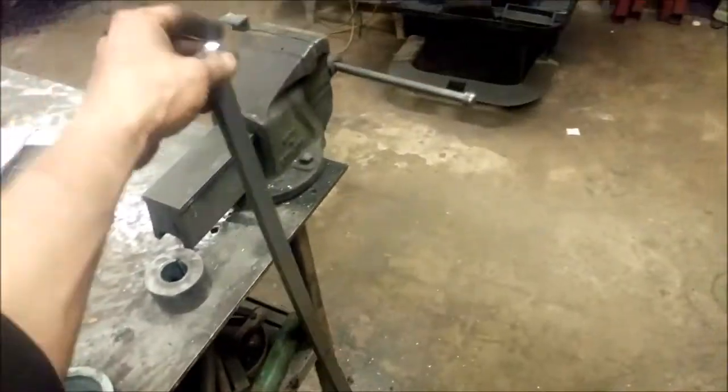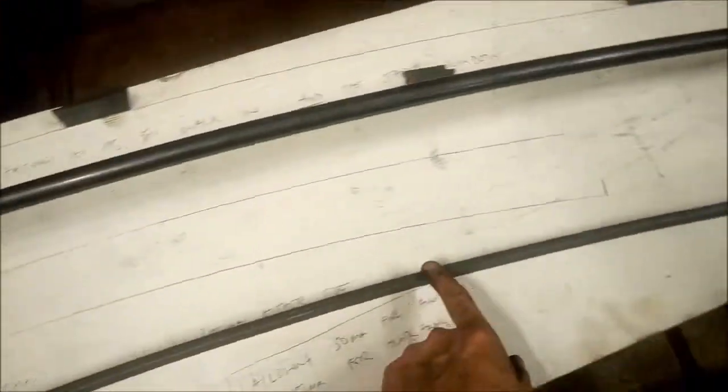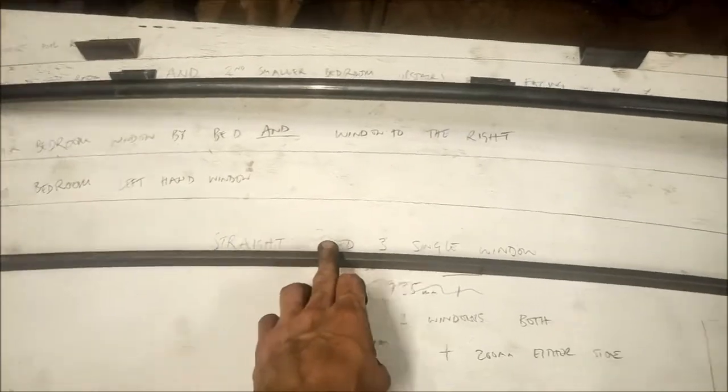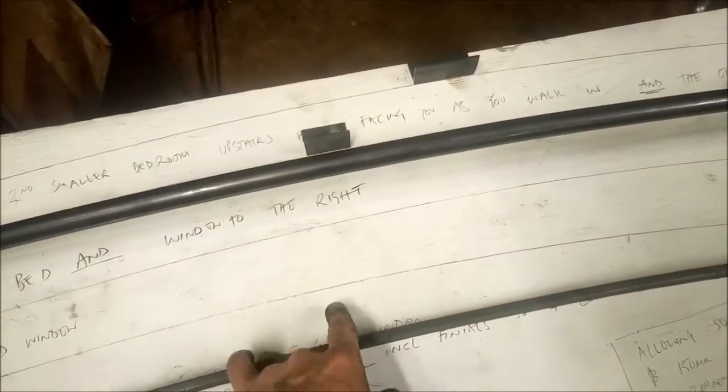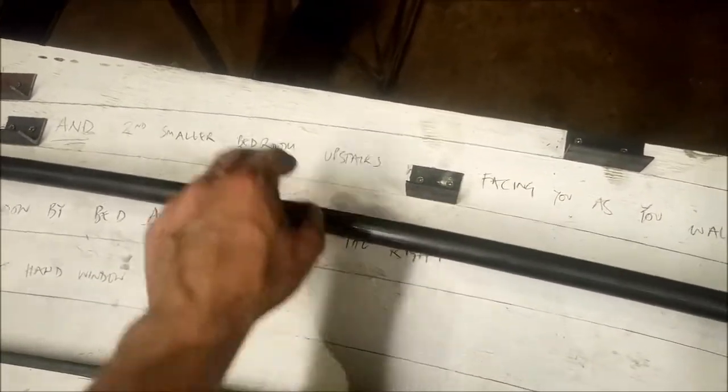Right, so when I went to the client's house, I took my roller with me and rolled flat bar, and each oast roundel was different in curvature, so progressively, it took 3 hours. There were 7 windows, so I curved these bars and then drew around them once they were to the right curve, and so these are these 1, 2, 3, 4.